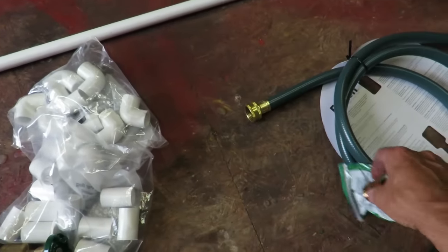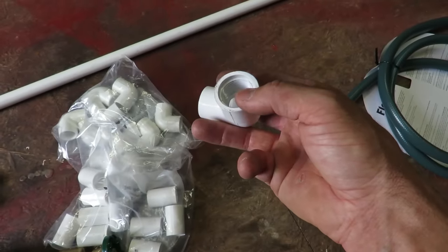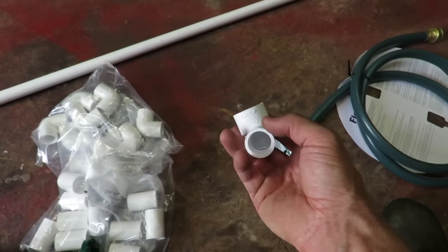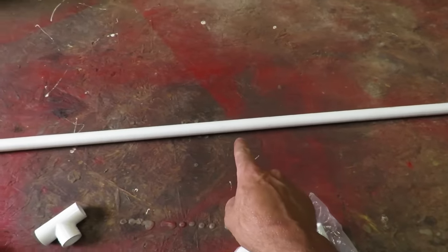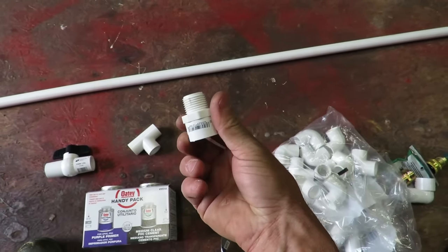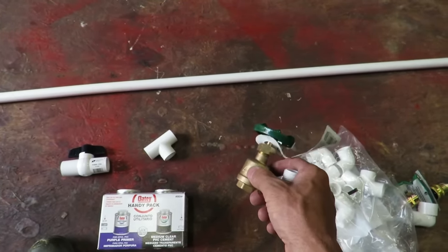I got a leader hose that will come off and connect to this adapter here, which goes from garden hose style to a national pipe thread style — you can see the difference in the threads right there. From there is where we're going to be adapting it into the PVC. I have an elbow that has the national pipe thread on the inside, it's three quarter inch, and then I have a half inch slip end. From here it becomes very easy because we're transitioning into only half inch PVC. We'll end up at the very end with a slip side to a half inch threaded side, and that will go into this spigot because the spigot has national pipe thread on the inside.